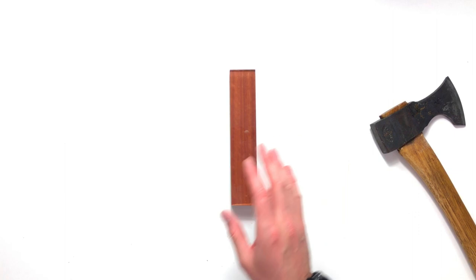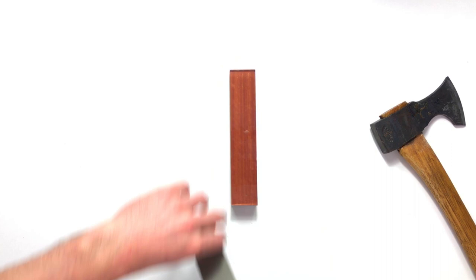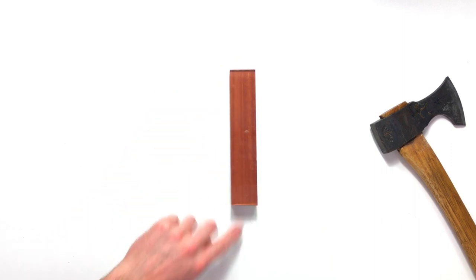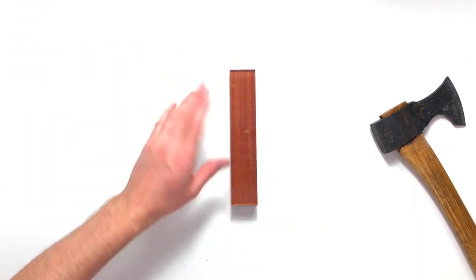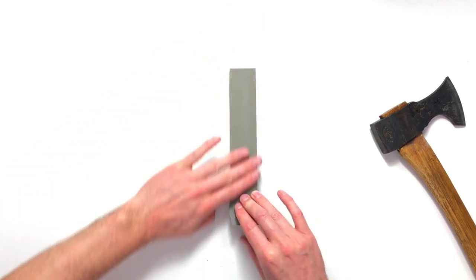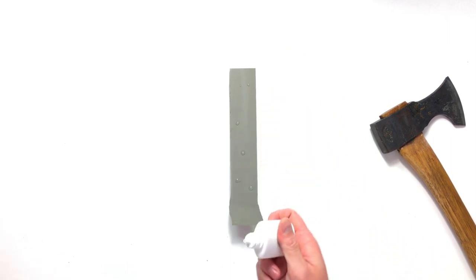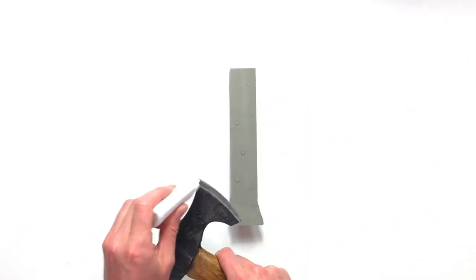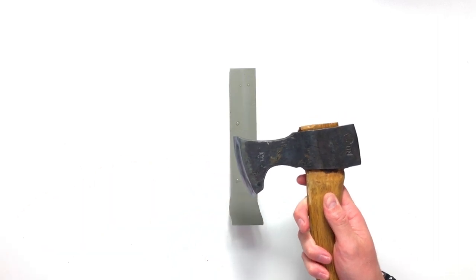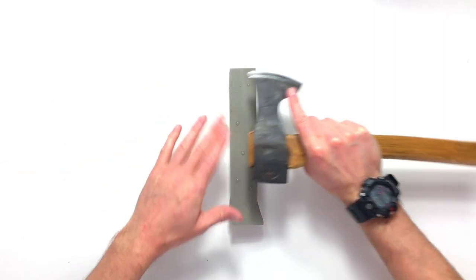Again, very nice and easy. You can wipe that down if you want each time but I don't think it's necessary at all — as long as there's nothing on the glass block that's going to create lumps or bumps. Although it's had a few fingerprints it's still absolutely fine to stick another strip of paper right down on top. We're ready with the water — I'll just pop a drop of water onto the bevel, both sides, to wipe off any of that 1200 grit. Now we're moving on to the 3000.